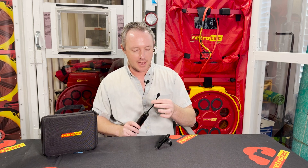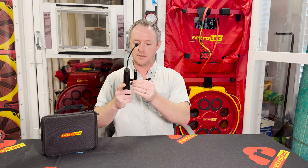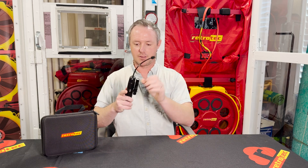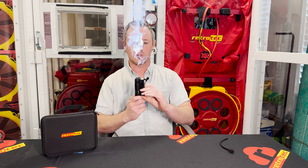We realize that a lot of times when these are used it might be in areas where there's poor visibility, like up in an attic or down in a crawl space or basement. The nice thing about using theatrical fog is that LED lights reflect off of it really well, so if you have an LED light shining on it you can see it a lot better. We've made a little attachment that you can clip onto the Air Tracer, and when you inject the fog you can turn on the LED light and really be able to see it clearly — that light just kind of reflects right off of it and almost makes it glow.